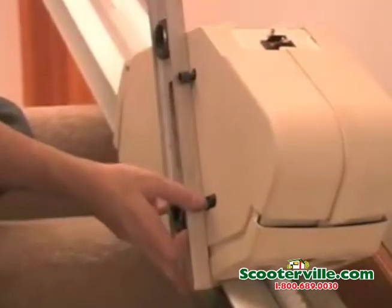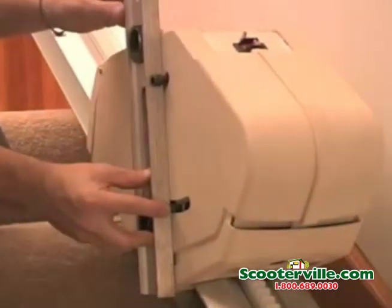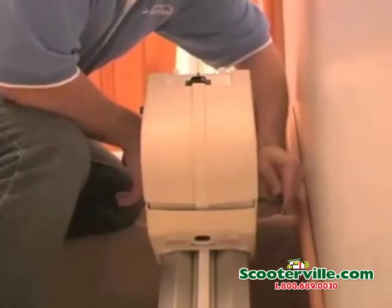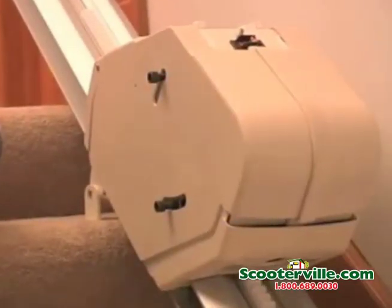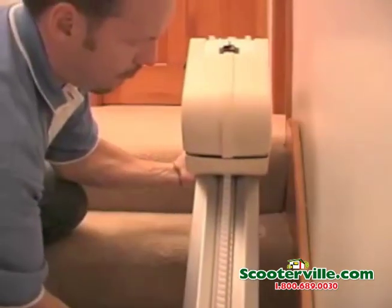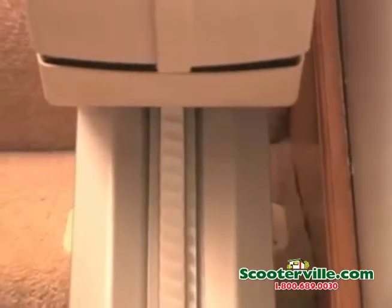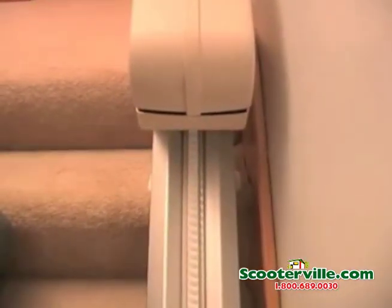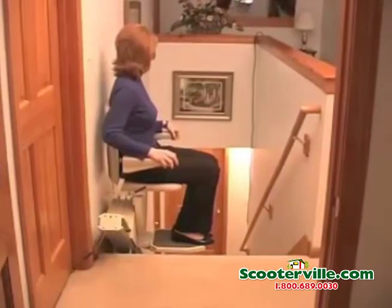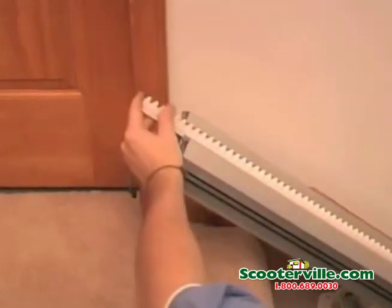Using a level, align the four seat leveling bolts to a vertical position. Firmly tighten the two bolts on the back side. Loosen the remaining two bolts about a half an inch. Position the rail so the edges of the mounting brackets are clear of the outermost projection from the wall — things like doors, windows, and pictures — accounting for the plumbness and squareness of the wall. The edge of the bracket indicates how far the back of the chassis and seat extends past the back edge of the rail. The back edge of the rail is generally one to one and a half inches off the wall.